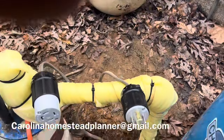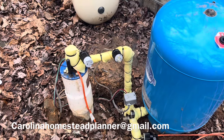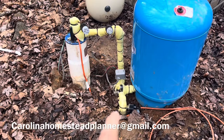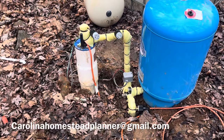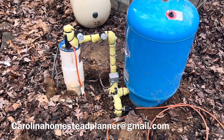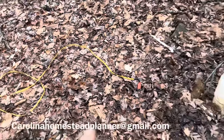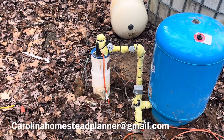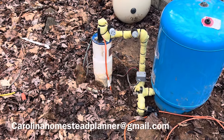This is a deep well pump, so you probably need a 5,000-watt, 220-volt generator to run it. It is now insulated — we're going to get down into the 20s or teens, so hopefully he won't have any more broken pipes and the campground won't miss any more water. If the power goes out, he'll be able to plug the generator in via this extension cord and have water. We're going to plug in the heat tape to this cord and temporarily bury it, because in the near future we're putting a big water system in here with a pump house, so this is just a temporary setup.